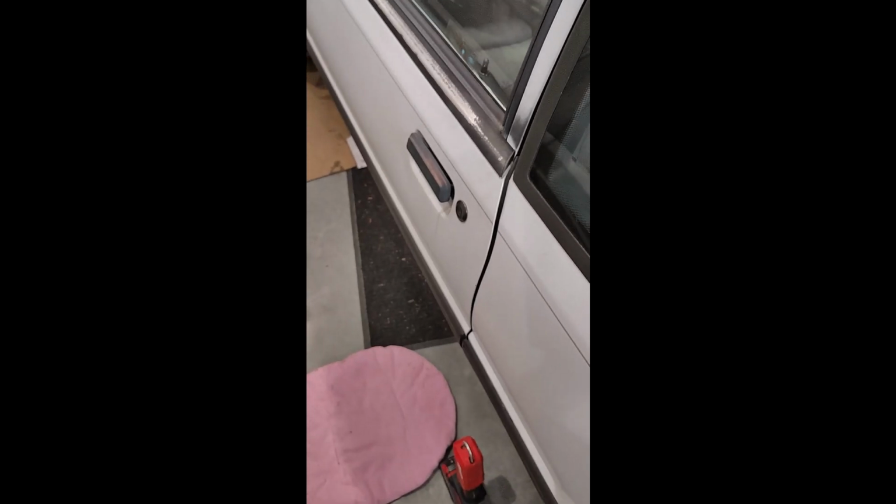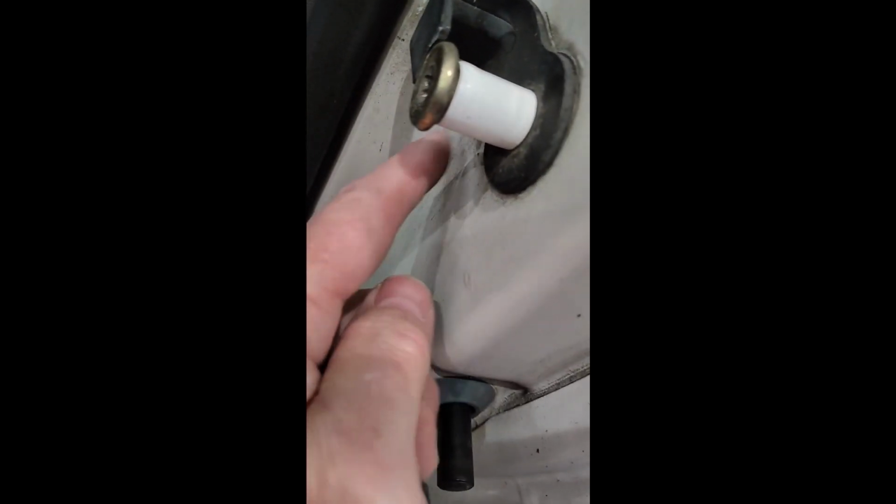So if you ever have to do that, it can be either a 5 or 10 minute job, or you take out, where'd it go? That fastener on the inside rear quarter molding, that fastener, and this fastener up here. Probably didn't see that, but behind the seat belt, and then you can pop this piece right here. You can just pop it off and stick your finger back in there, grab that nut, capture it, and away you go. It'll fall right around in here, and you can just kind of get in there. But that's a pain if you can avoid it.